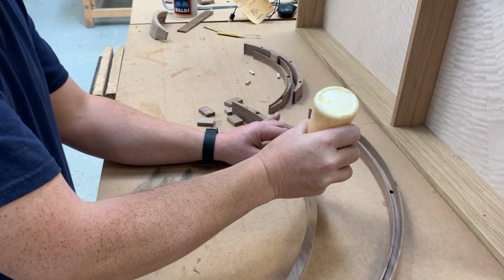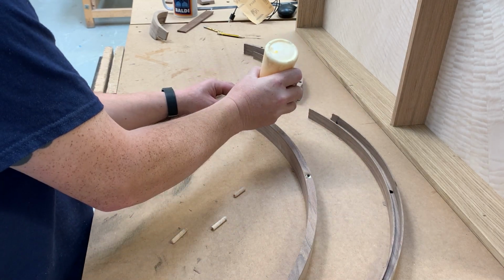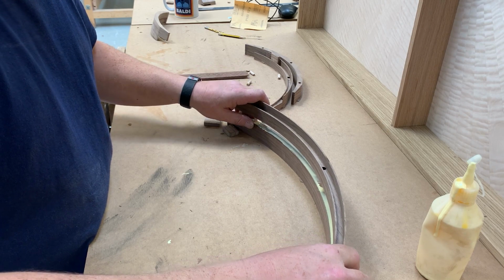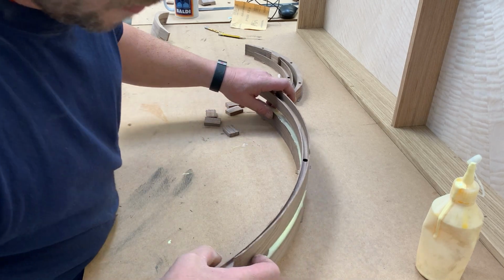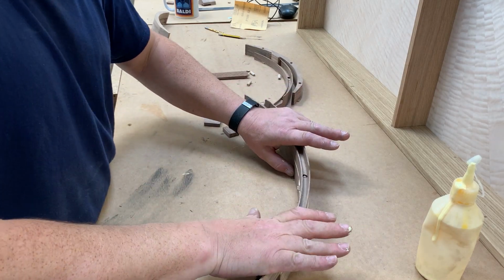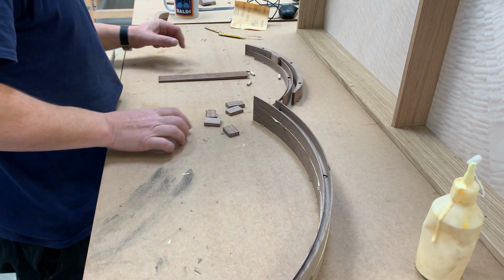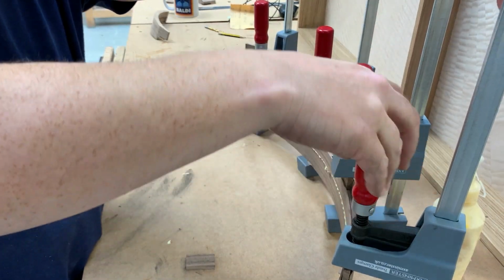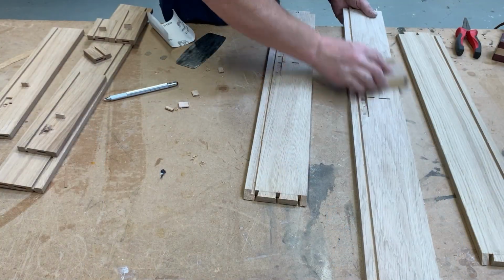Smaller pieces were fine to cut out on the CNC from one piece because of the depth of them, but these larger pieces, they needed a much deeper piece of walnut, which would have cost an absolute fortune. So I took advantage of the CNC machine being so accurate and cut it into 3 pieces and glued them together. A few dowels through there to locate and keep it all lined up. It was all good.